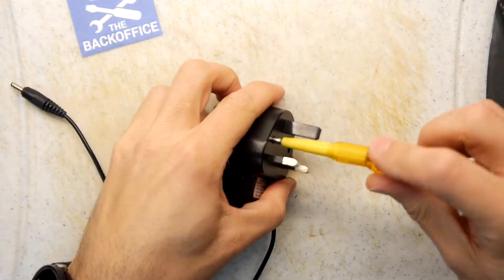Is there a hidden screw in here? No. So it's a 5V, 110-240V — the usual thing. No fuse, but we never expect fuses inside these things. It's got that smell — that lovely smell of burnt electronics. The input side seems okay, there's no harm there. But look at this side — it's on the actual output end and it does look very charred around this diode.